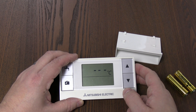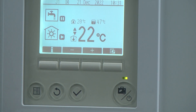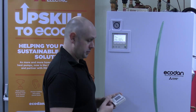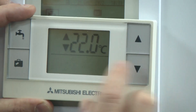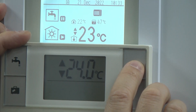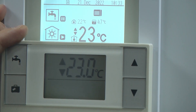When you change the battery in these, give it a chance to actually start doing the handshake — it takes a little while. It's already recognized the wireless receiver there, although it's not actually showing on the wireless receiver itself yet. You can tell everything's working: it says room temperature 20 degrees, 22 — there's still a little J1 or J0 fault at the top just while it finishes the rest of the handshake. Be patient — it takes a little while. That took about five minutes, but now you can see it's come up with the same temperature on there, and as I change it, that changes on the actual screen as well. Be patient — that took me a good five minutes before it came through.